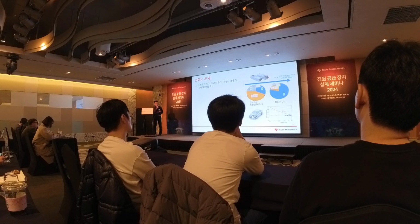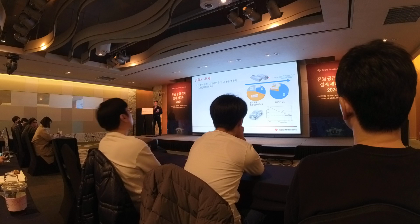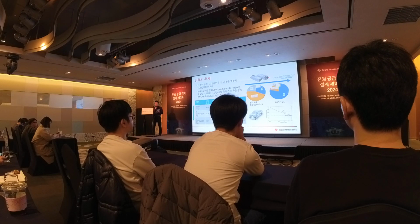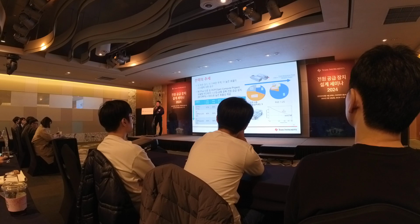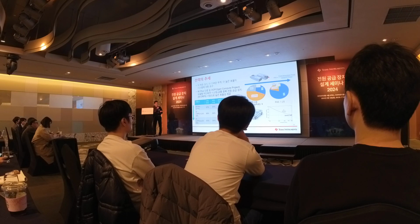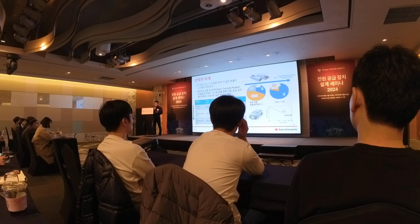The second thing is EV and HEV applications, where weight is money. If you can design your power supply to be lighter and minimize the transformer size, then your car can run more efficiently. The other trend is certification, for example 80 Plus Titanium, and the Open Compute Project committee's OCP standard called M-CRPS, which define the efficiency numbers you need to meet in order to get certified.